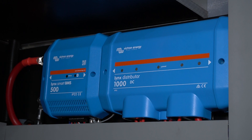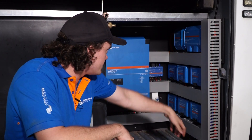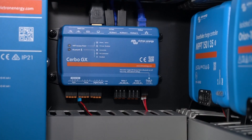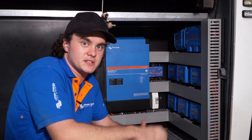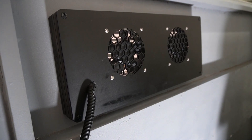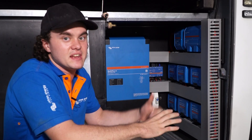Coming up here, the Lynx setup is used as one big bus bar for all the connections hidden under the ducting. We've got the Cerbo over here — the brain of the system. A big part of this one is that Victron has recently released an update that lets you control relays based on temperature probes connected to the Cerbo. We've taken advantage of that by running two big fans connected to vents we've installed on the side of this door, responsible for moving all the heat this system creates under load out into the open and keeping everything cool.